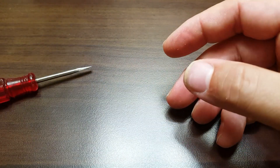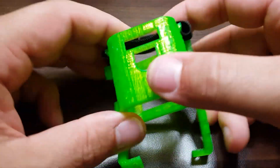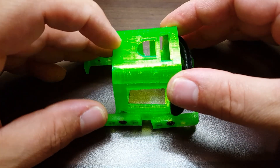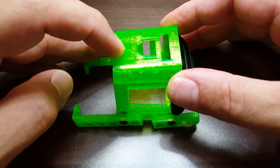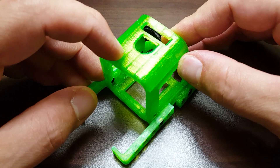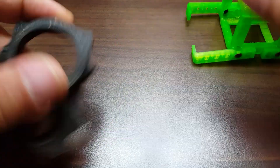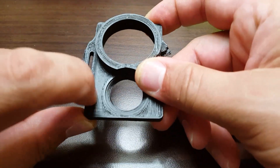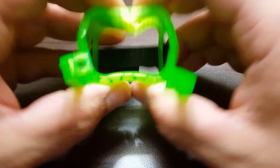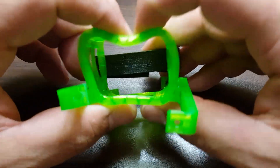So what can you do? Here's what I'm here to tell you about. This is a material called thermoplastic polyurethane, TPU. And this stuff is amazing. I don't know if it just got invented or what, but I've only just started seeing it coming out in the 3D printing world. The first time I saw it was Andy Shen — he prints the Mako pod out of this stuff. And when I heard that Andy Shen was 3D printing a quadcopter pod, I thought, well, Andy's no idiot. But I figured if you print a quadcopter pod out of this stuff, it's going to shatter, it's going to break, it's not going to be strong enough, it's going to be heavy. But check it out — look, that's 3D printed. It is flexible, but sort of semi-rigid.